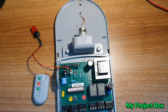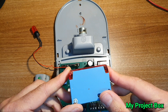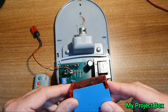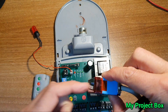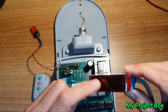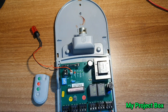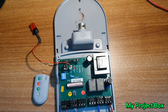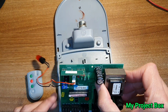This connector here that I've linked up is for an optical sensor. I assume if something passes underneath the door it breaks the beam — there's a reflector on the other side, it shines presumably infrared light onto the reflector which bounces back to a photocell inside. If you break that beam it interrupts the door for safety. I don't have the reflector so I've linked it out, but still the unit doesn't work. Let's flip the board over and study it.